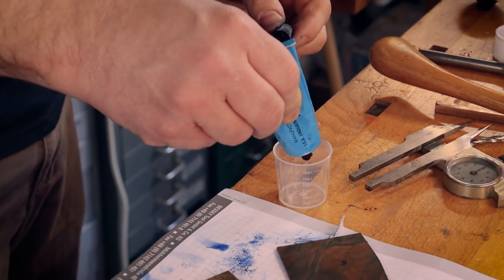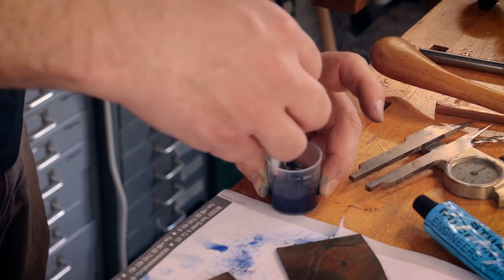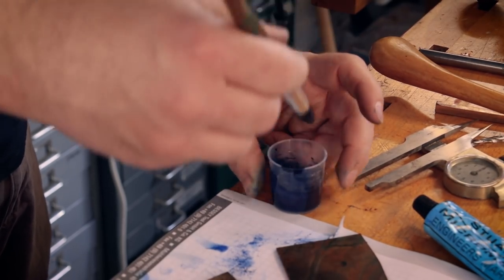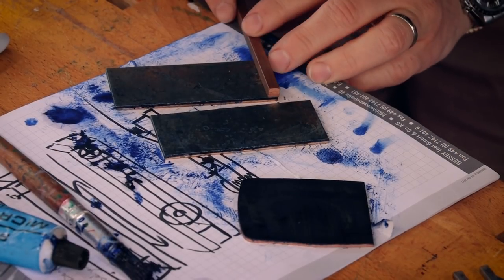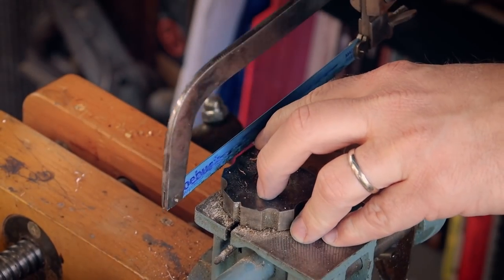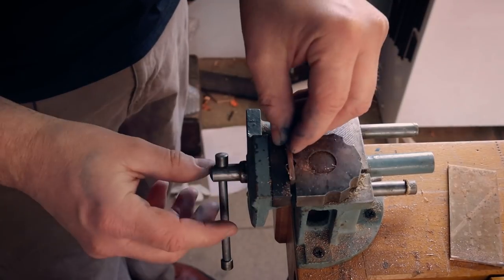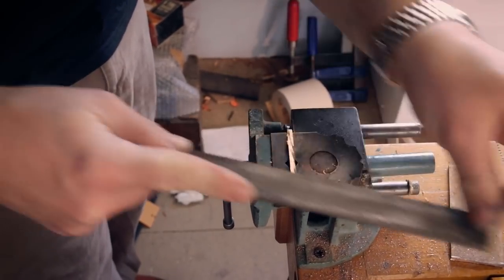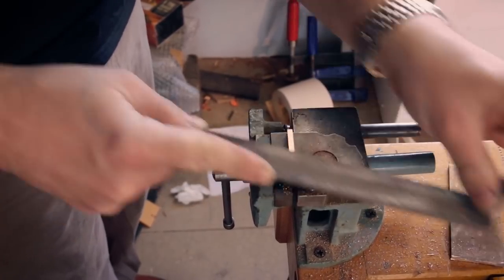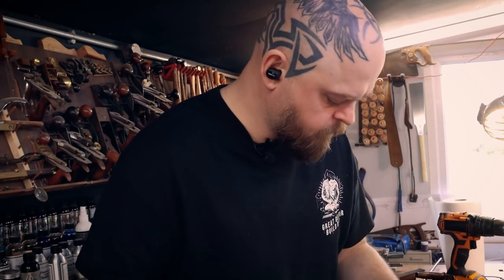I'm not going to clean this up. I am, however, going to start by adding some engineer's blue on it. If you don't have real engineer's blue, just some Sharpie would do absolutely fine. And I'm going to scribe the cuts that I need to make and essentially start using the hacksaw, jeweler's saw — anything that will cut accurately. I'm going to be peening in some of this round stock to hold the back end of each saddle together. It's going to be fun.